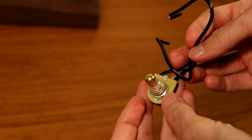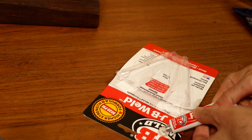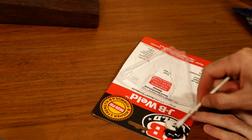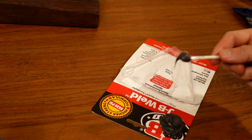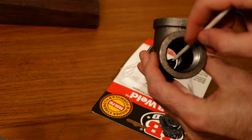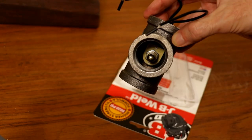I'm using a brass switch, but I'm disguising it behind a water faucet handle. First, I'm going to epoxy the switch inside the one-inch T-fitting. Basically, the idea is to put a heavy dollop or a large puddle of epoxy in the bottom of the T and set the switch in the puddle. When the epoxy dries, it'll keep the switch from moving around when I turn the lamp on and off.